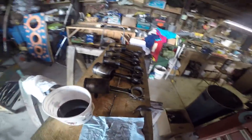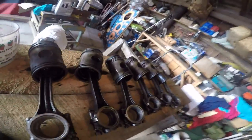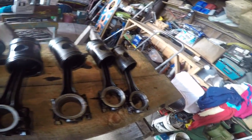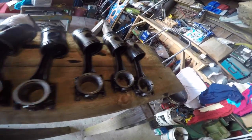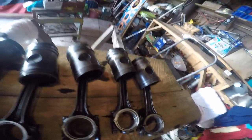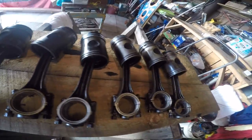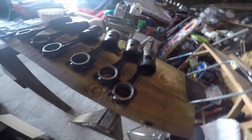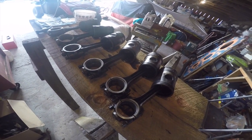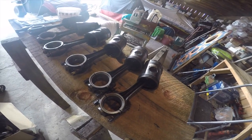They haven't made them in years and it's getting really hard to find parts for them. But back in the 60s and 70s it was a really popular engine — a lot of equipment had them, a lot of trucks. I had a GMC Brigadier log truck with a 671 Detroit in it. The reason they call it a 671: each piston has 71 cubic inch displacement, so it's six cylinders at 71 per hole. They also made a V8 called a 318 and even a V12.